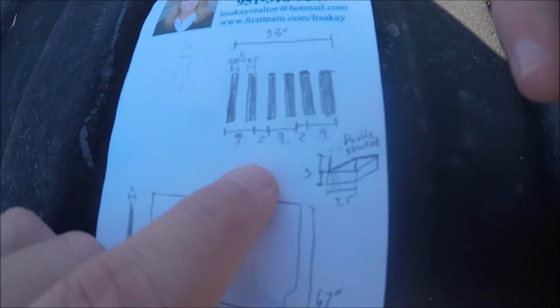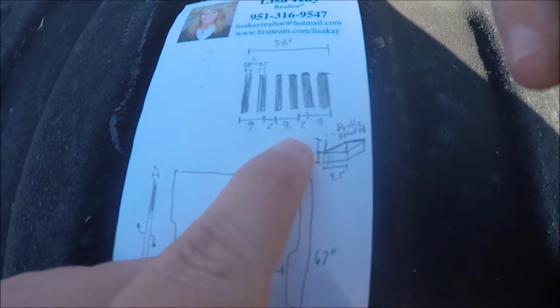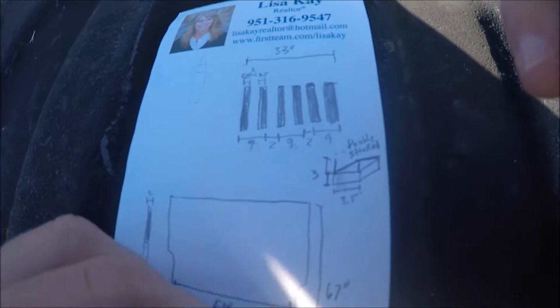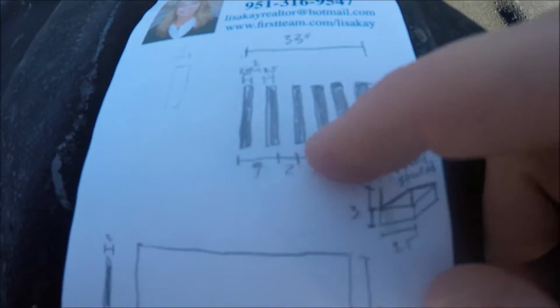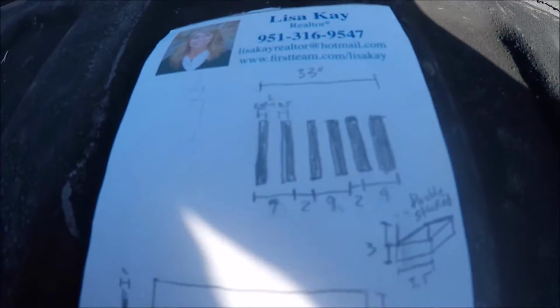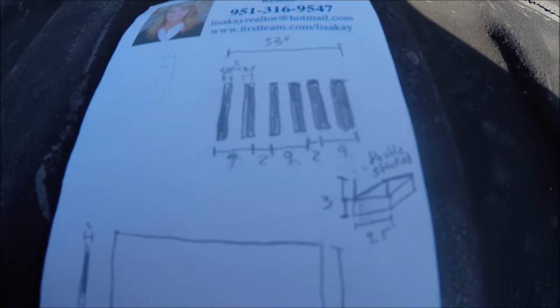I have the dimensions already kind of laid out. As I said, we're going to double stack them, which makes them 3 inches tall because they're not exactly 2x4s. They're 3.5 inches by 1.5 inch wide, if you didn't know that. So we're just gonna lay them with a 2-inch offset in each one, which is basically how wide a BMX bicycle tire is. And so we're gonna lay them just for one bike. That's going to be 9 inches wide altogether.